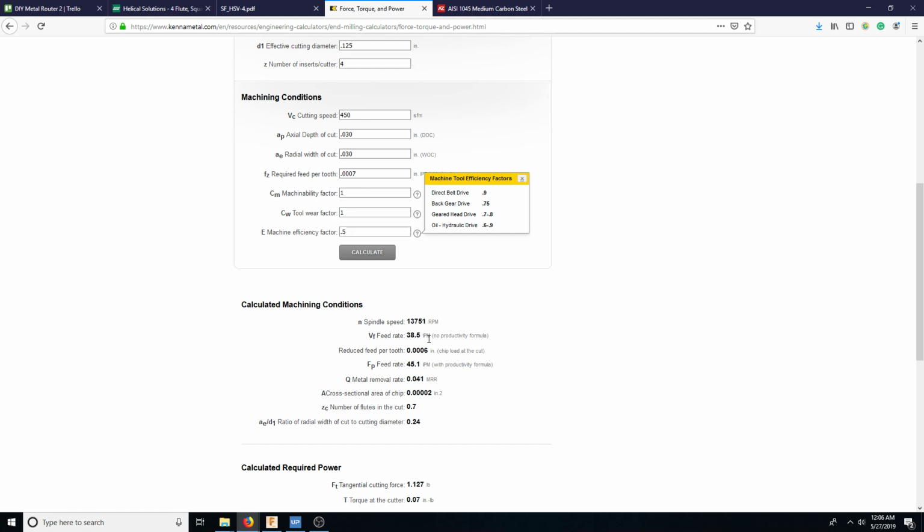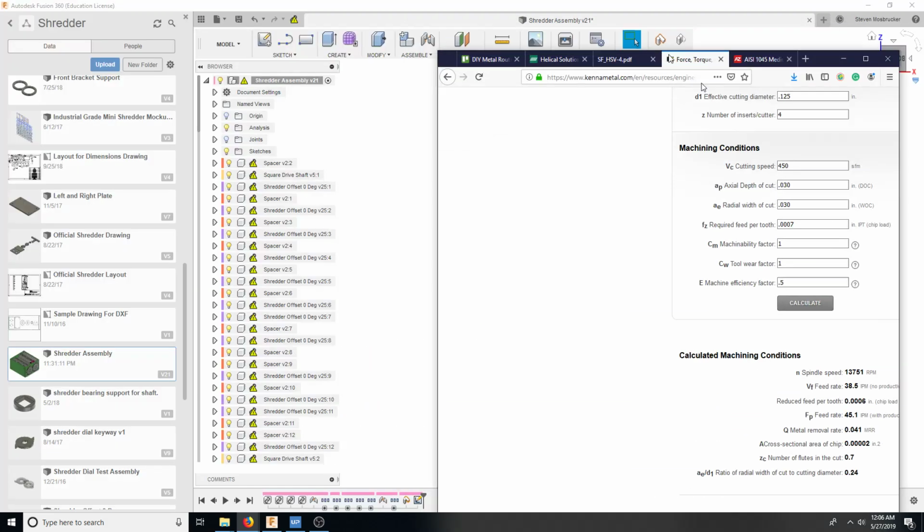And yeah, so that's number 1. Number 2 is that you have to buy more expensive power heads or spindle heads in order to get up into these RPM ranges. Because again, a spindle is not really designed to go really, really fast. It's designed to be extremely rigid. So that's number 1. Number 2 is that a lot of these off-the-shelf spindles for wood routers have actually stated that they have pretty good runout. So pretty low runout. So if we go to AliExpress here.